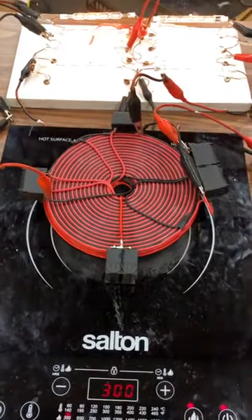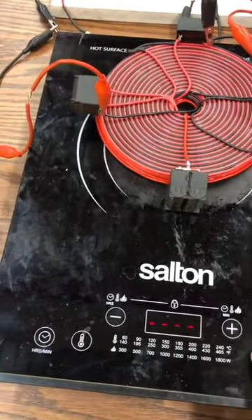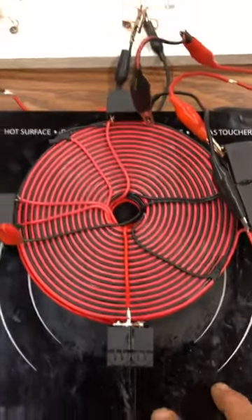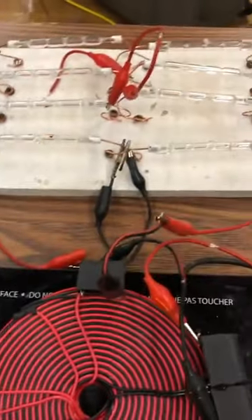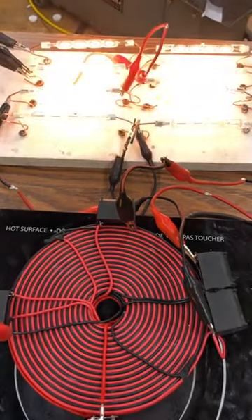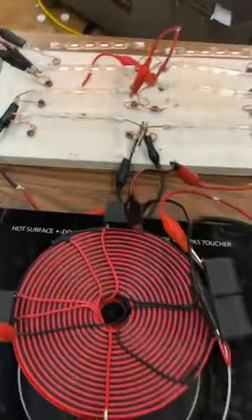I finally finished the design — it's complete, it's stable at 300 watts. I can turn it off and on without touching anything; it starts and stays stable at 300 watts. The positioning of the coil is important for balancing the load between the two feeds. One feed has two kilowatts on it and the top coil has one kilowatt — they're about 95% brightness, good and bright with plenty of heat. It's a great heater.